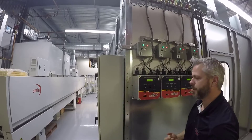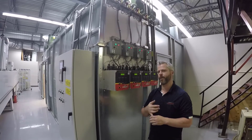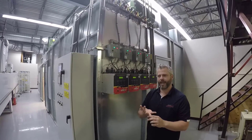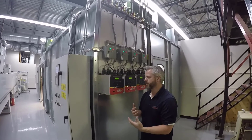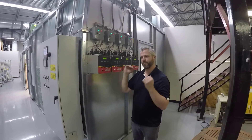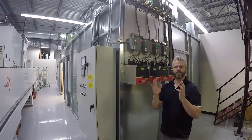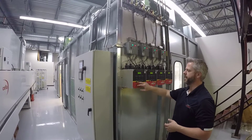There are a few reasons for infinite mode. If I'm running an automated spray line where I'm filling a rack every seven minutes, I don't want to turn it on and off constantly. Another application for infinite mode is a constant through-feed system — like a tow line pulling parts past a number of Sunspot panels, or a conveyor line with finished pieces of furniture passing through. Those are common scenarios where you'd want to run infinite mode.